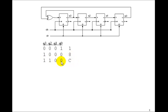We've got a 1 and a 0, exclusive-OR is still 1, so we get 1, 1, 1, 0 as these shift over — that's an E. Then a 0 and a 1, exclusive-OR is 1 again, giving 1, 1, 1, 1 which is an F. But now Q0 is 1 and Q3 is 1, exclusive-OR is 0, so a 0 comes into Q3 and the 3 bits shift over — that's a 7. Then 0 XOR 1 is 1, giving 1, 0, 1, 1 — that's a B. Then 1 XOR 1 is 0, giving 0, 1, 0, 1 — that's a 5.